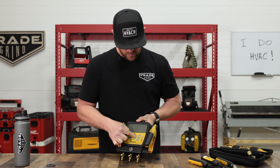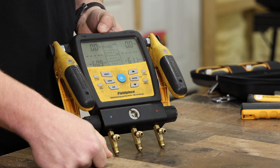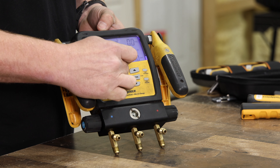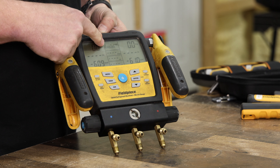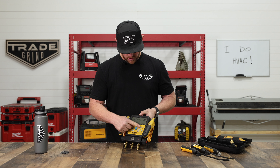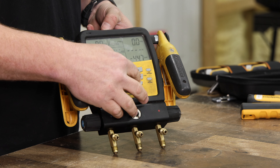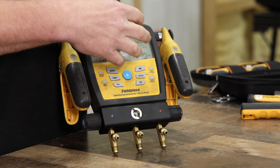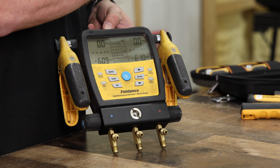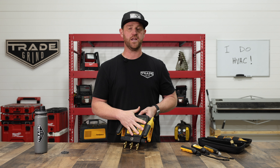Dialing into the manifold itself — you can press that and the light comes on. You can go through all the different refrigerants. Right now it's on R410A, but you can change it to R22, R438A — the list goes on. It's got all refrigerants built in, so you don't have to manually transcode temperature versus pressure. It's all built in here.